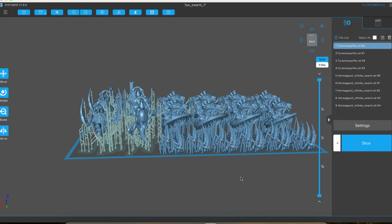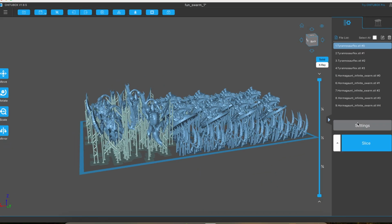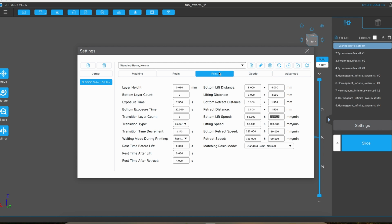If you fill the build plate, there's a bigger risk of print failure due to the greater suction effect. Reduce the bottom lift speed to resolve this. Everything needs superglue. It seems obvious, but I'm being spoiled by building plastic models with plastic glue. Buy high viscous superglue as it avoids spill and makes it easier to place where you want it to. And an activator spray, it's a game changer. All super cheap, and I'm not going to use superglue without it anymore.